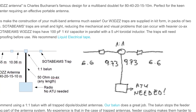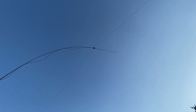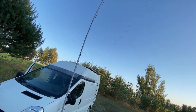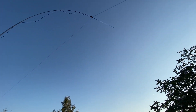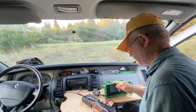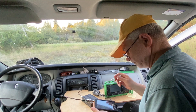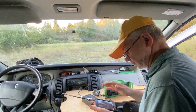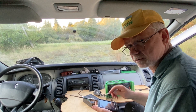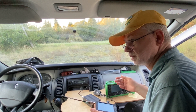This is normal — the difference exists because factors influencing the antenna like antenna height, ground and soil quality, etc., can be very different from what SOTA Beams measured or even from my first location. Before connecting the antenna to my ICOM IC-705, I connected it to my Nano VNA, just to get one picture showing where the dips are, which bands this antenna is resonant on, which bands it's not, where we need a tuner, and where we probably don't.